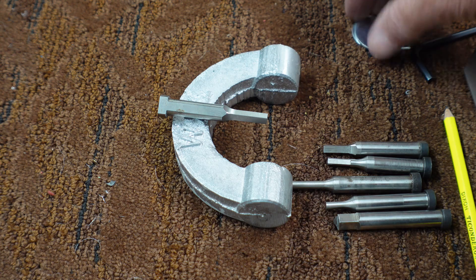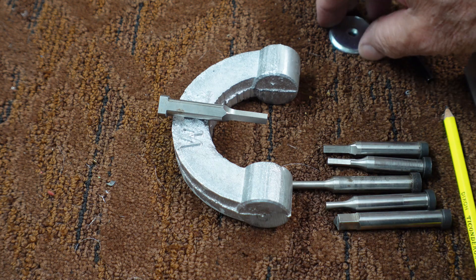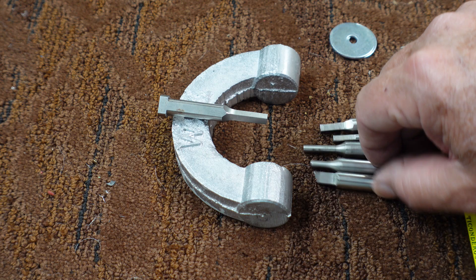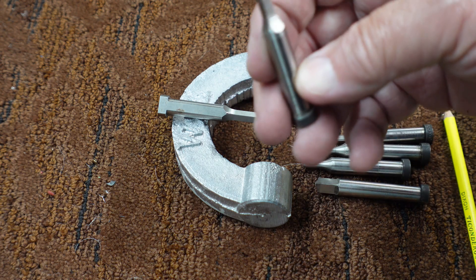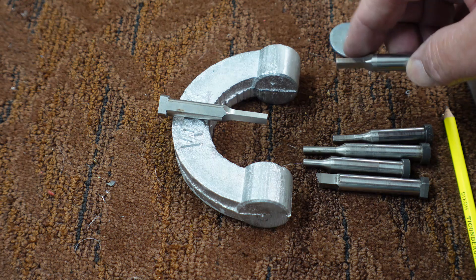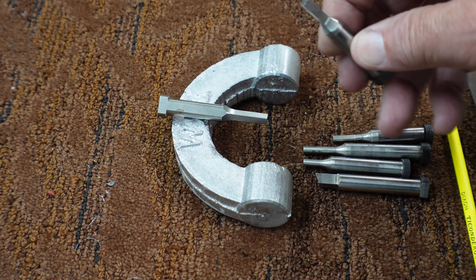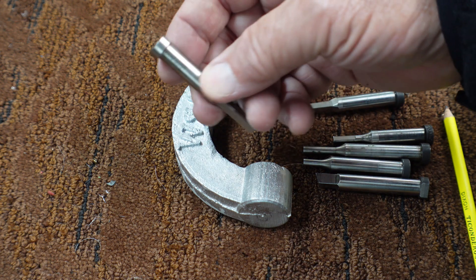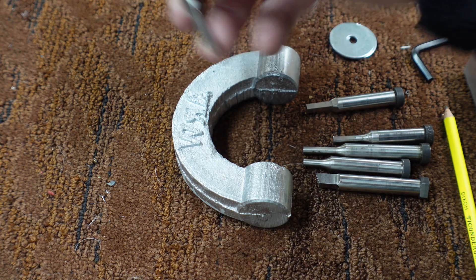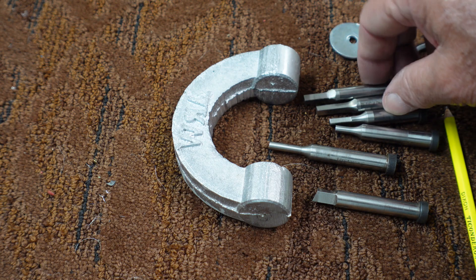For the first time the other day, I took my wife to the flea market with me. She had a great time — we didn't get very far because she stopped at every table looking for bargains. But right at the very end, I came across a table that had some machinist items. I picked these up — I paid ten bucks for a half-inch ball end mill, a key seat cutter, and a large boring bar. Not a bad buy for ten dollars. I thought these might work real well as the tool that comes through for cutting the balls, and I can grind them to make various tools. That way I don't have to broach a square hole — I can get away with using round tooling.